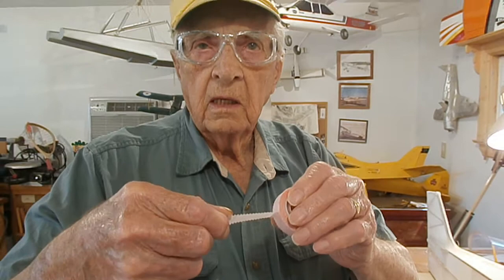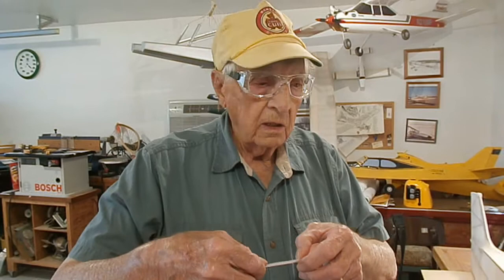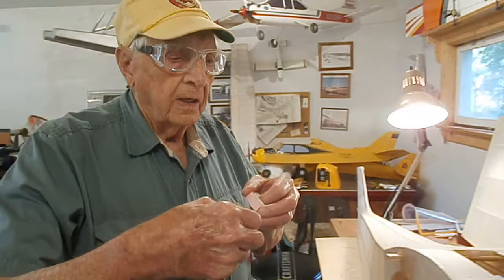It's what women use on their hair, and it's just perfect. It's like pinking tape and it's the perfect scale — a quarter to a half inch wide. I found out I could buy this at the drugstore. It's thin and it sticks well, and when you dope over it, it works out really nice — it looks just like a full scale tape. So what I do, I put dope on all the seams first.